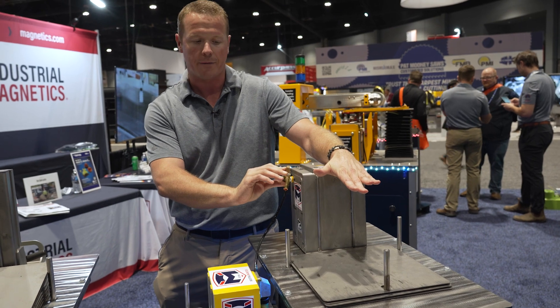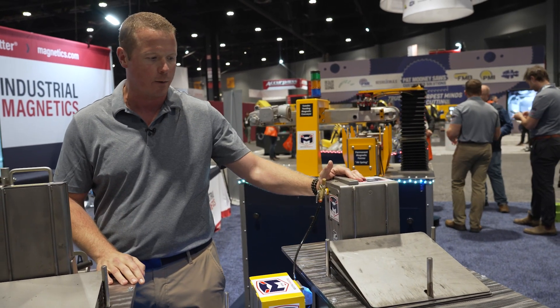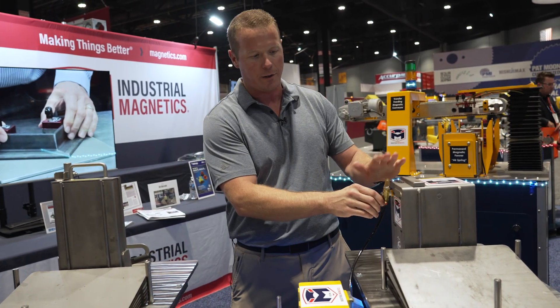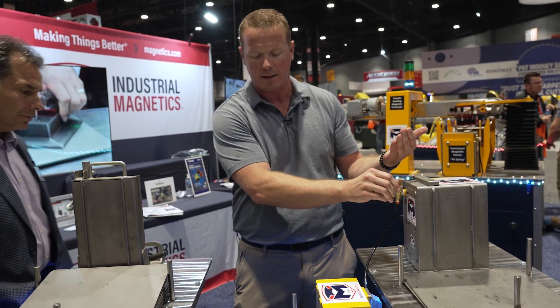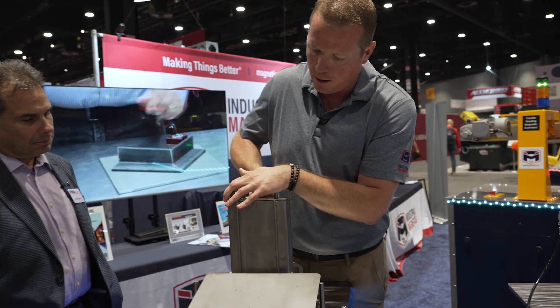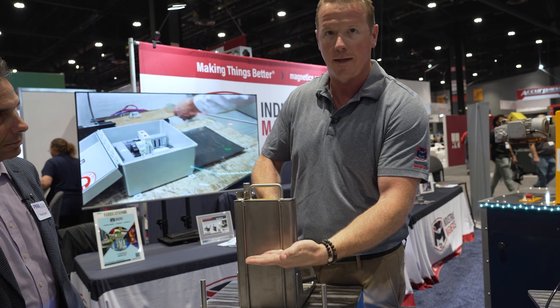This technology is used often in automotive stamping, or I did one the other day that they were using to fan sheets for making ovens in your house. The advantage here is you can turn the magnet on and off. It moves it in and out to move the metal to and from the stack. This magnet is nice because you can disengage it by lifting up, and it will also index down as the stack gets lower and lower.